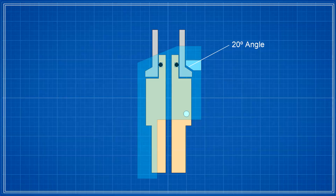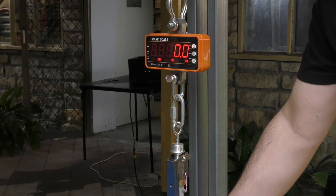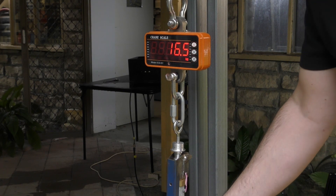So we machined down the contact angle back to around 20 degrees to reduce that force. Let's go again — I'll hold it this time. This results in the primary lever still easily opening but the load required to keep it closed is closer to around 5 kilos. Okay, that's good.